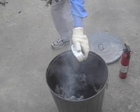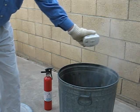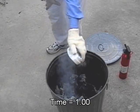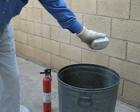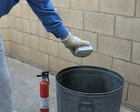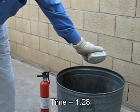The sensor in the airplane carbon monoxide detector is on continuously, and that's why it's able to pick up carbon monoxide so quickly. But I've come to learn that on some of these newer units, the sensor is not on continuously. They do something called sampling, where they bring the sensor on and off periodically to sniff for carbon monoxide. That may explain why it's taking so long to respond. We'll give it about 30 more seconds. Holding the unit down so that the sensor has the best chance of picking up monoxide. And as you can see — nothing.